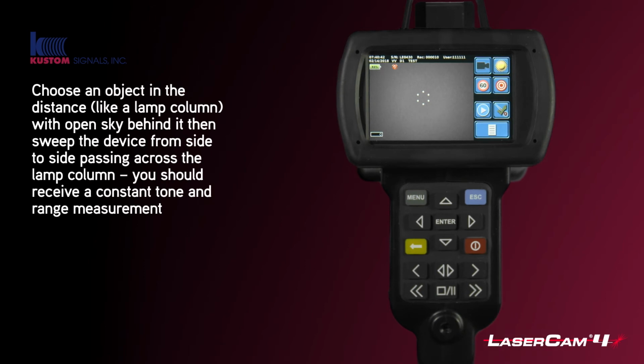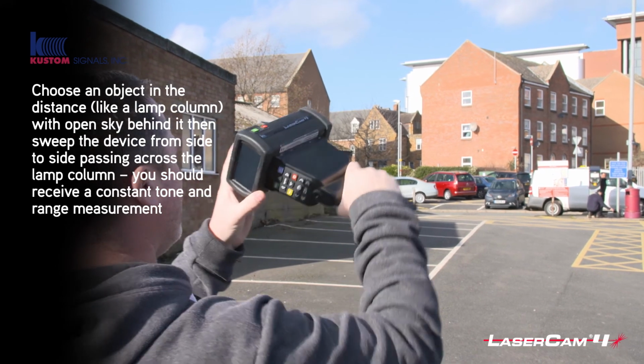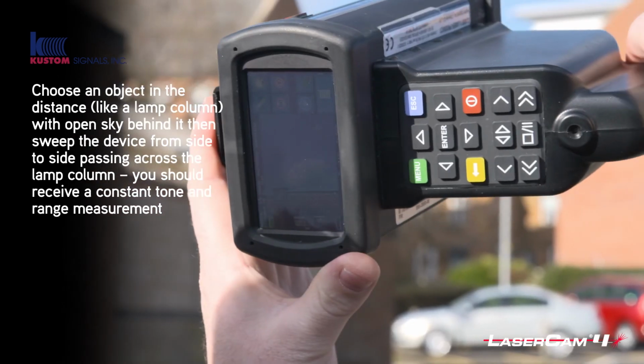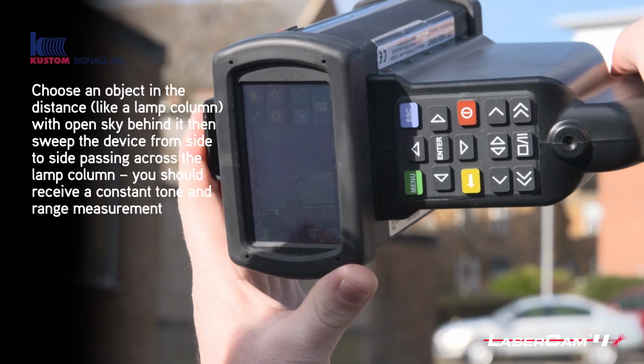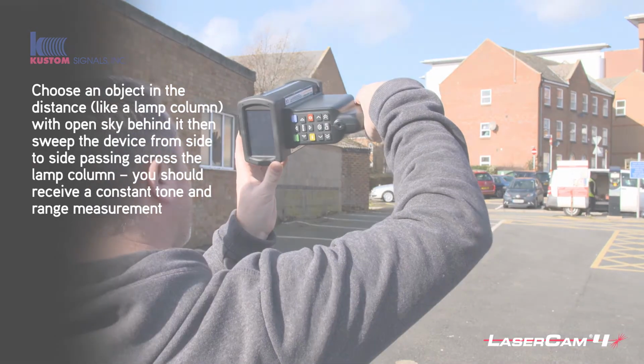And you want to see that when the reticle of the camera and the HUD is in alignment with the pole, you then know that you've got the correct alignment between all of them devices. And then you turn the camera 90 degrees and do the same thing just to check the vertical plane as well as the horizontal plane. When you've done them, you can then finish.